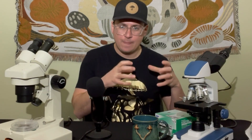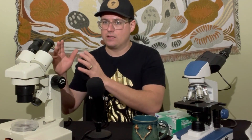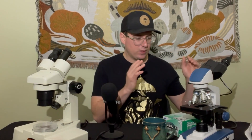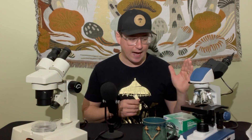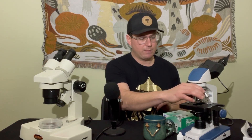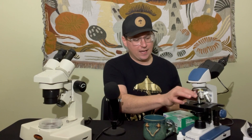A compound microscope is more laser-focused — small field of view, very high resolution — as opposed to the stereo microscope, which is like a spotlight: a really wide range of view, not as high resolution. The compound microscope compounds the magnification all the way from the top ocular to the objective lens, and you can switch between different magnifications to get more or less precise, wider or narrower range of view.